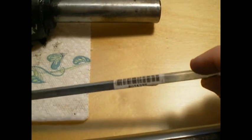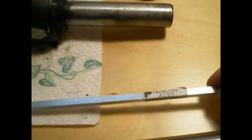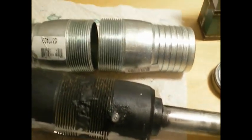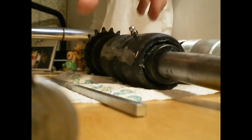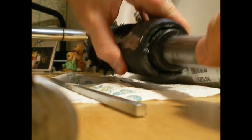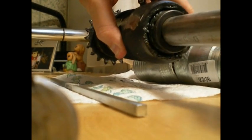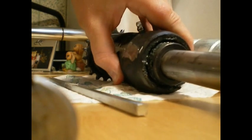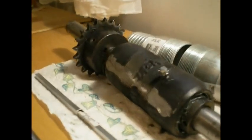Price-wise, this shaft was about $48. The keyway — it's one-quarter by 12 inches I believe — was just a couple of bucks. The bearings were I think maybe eight bucks a pop. This fitting is $4.50 or something like that. So generally speaking everything was really good. And if I even place the camera here — it just works really well, spinning it works really good. I'm really happy. Pillow block bearings are fine, but if something's not lined up right exactly, you're going to have a world of trouble — always your chain falling off, and it's a big pain in the rear end.